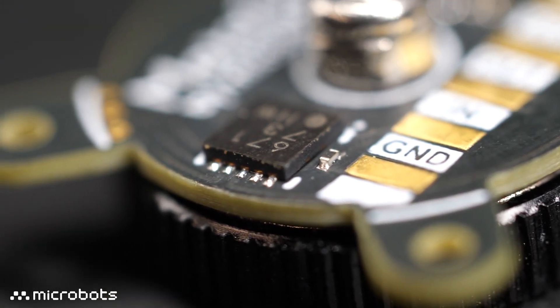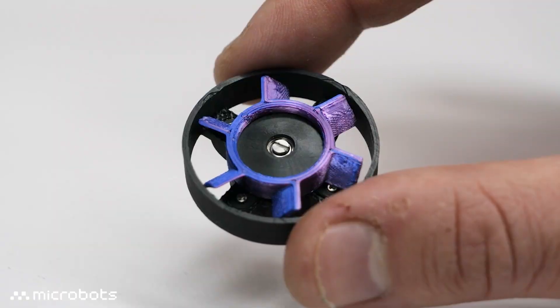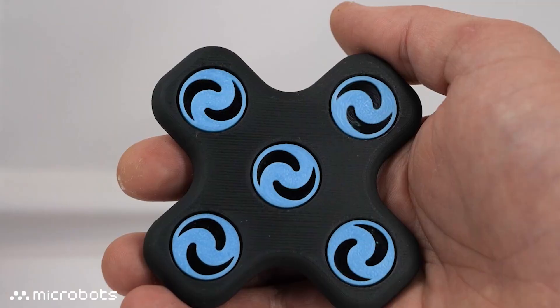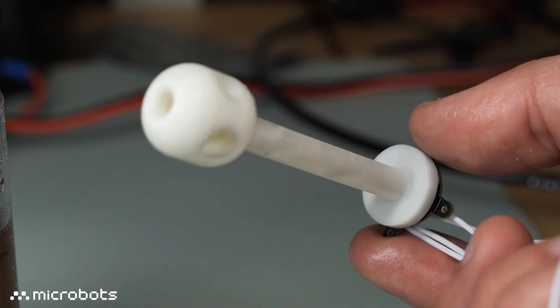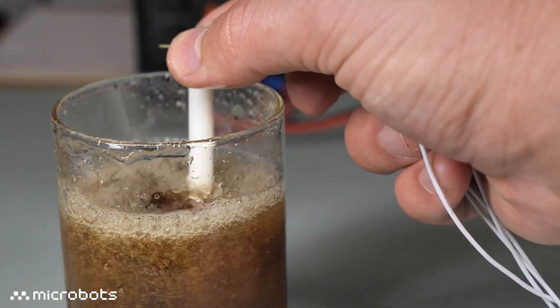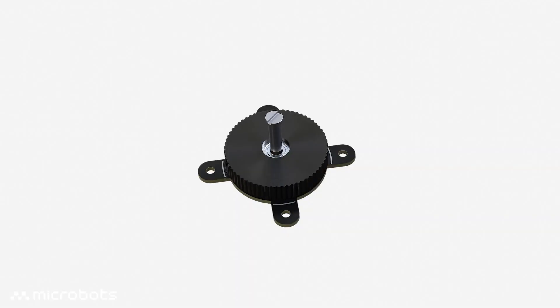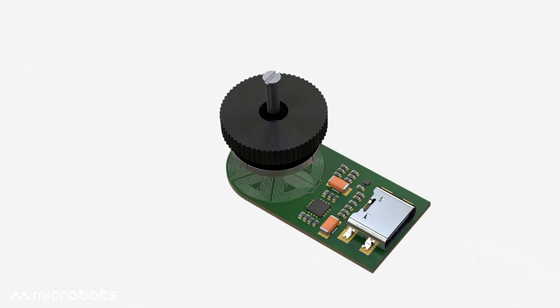We also made an Arduino library that features a PID controller to better regulate its speed. The motor was designed for high-speed, low-torque applications, so with it you can build things like tiny blowers, robots, kinetic signs, generate vibrations, and build other cool gadgets. Its stator design is open source, so you can also get the rotor parts and easily assemble it onto your own custom PCB.